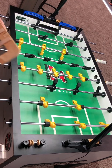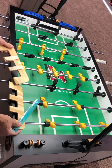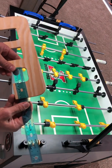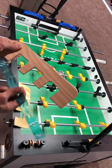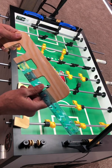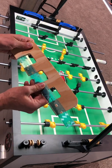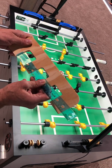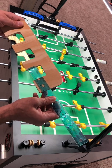If you're interested in doing it yourself, like I said, I did just use 1/4 inch plywood. On the one with the wider openings, for the most part I was at about 2 inches on both of the ends. The middle one was about 1 3/4 inches, and I think I was close to 1 3/4 inches on all 3 of these openings here. It looks like I was right about that 1 3/4 inches mark, and pretty consistent on this one here too.